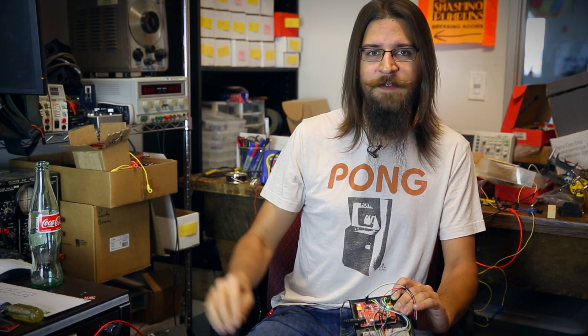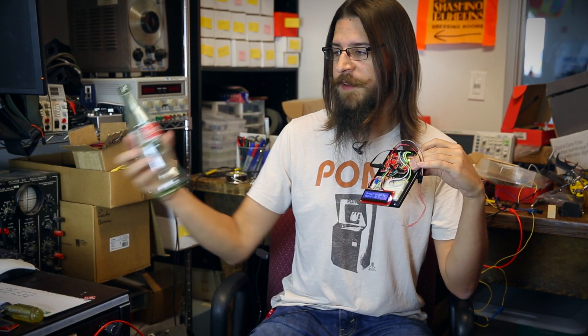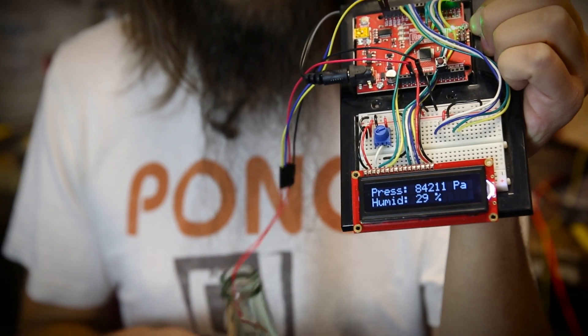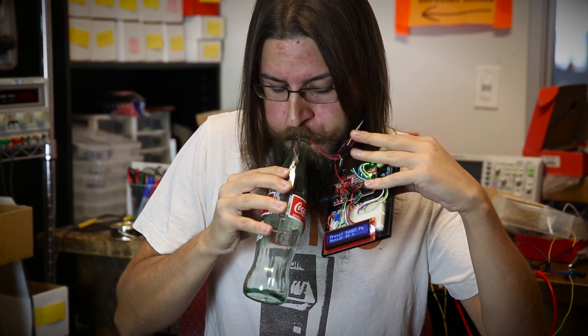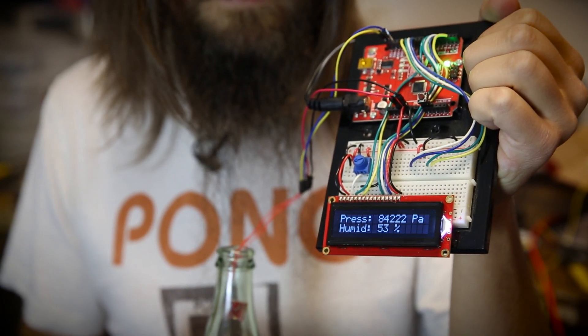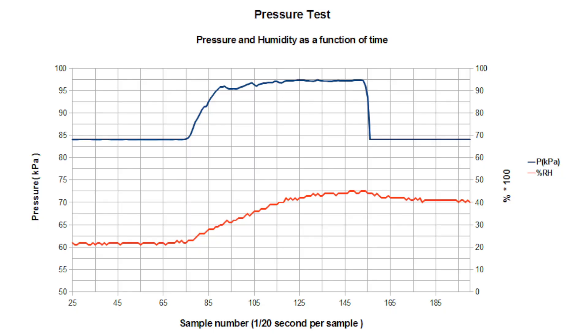I've got a couple of sketches I've used to demonstrate it. The difficulty of working with pressure and humidity is that it's very hard to test. So what I'm going to do is place them inside of this bottle and pressurize it with my lungs. The pressure at sea level is about 101 kilopascals, but we're about a mile up, so we're at 84. We start off at regular atmospheric conditions for our altitude. The pressure went up to about 94, and if we consult Wikipedia, we see the lungs can only produce about 10 kilopascals — that's about right. And the humidity jumped up as well. This is all as we expect. I like data, so I made a graph of what it looks like graphed over time.